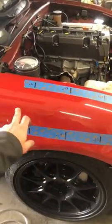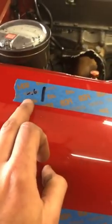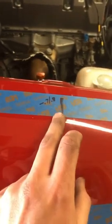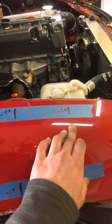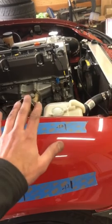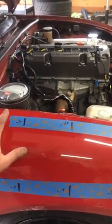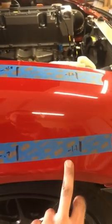We tested six separate areas — didn't test the center area because it's so curved that the vents wouldn't fit there anyway. Here's what we found: negative 0.6 inches of water, negative 0.7, negative 0.8, negative 1.0. We got more negative pressure as we moved forward on the fender — as the air hits the front it creates a lower pressure zone, but starts to repressurize the farther back you go. We saw the same pattern on the bottom: 0.5, 0.7, and negative 1.1 at the bottom.